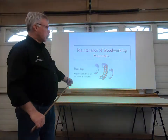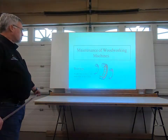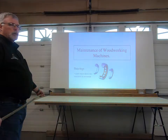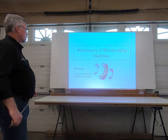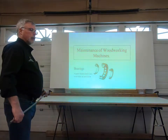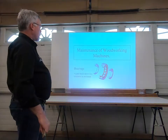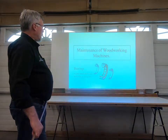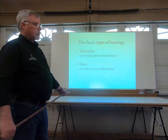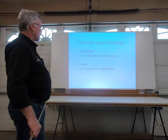Hi folks, we're going to carry on with more maintenance issues today. I want to talk about bearings. You're going to find bearings in a lot of parts — anything with a moving shaft or spindle of some sort, there's probably going to be bearings, either friction, anti-friction bearings, or sleeve bearings. What they do is they prevent and minimize the heat buildup that can occur between a shaft and a mounting bracket or something like that.